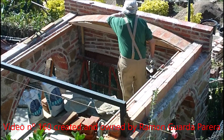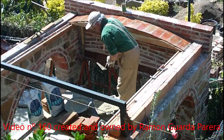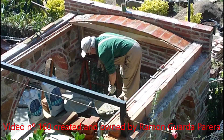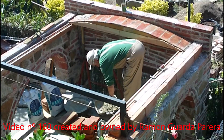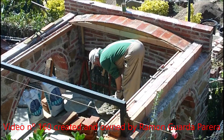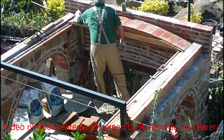Before putting mortar, you have to wet the area well — with a wet brush if possible, much better. Then you can see the system of placing the second layer or second thread. I'm using quick-setting cement mortar. To knead, I used water from a small container mixed with a retardant to delay the setting time about 10 minutes — that is the time I have to use it. The mortar with retardant can be used like Portland cement, but with the advantage of faster setting. It can also be done with mixed mortar.